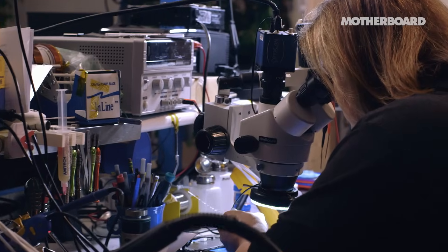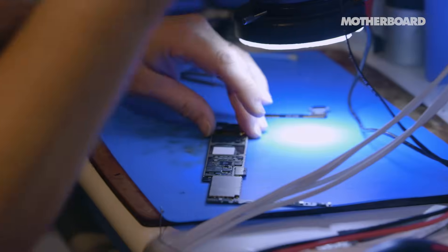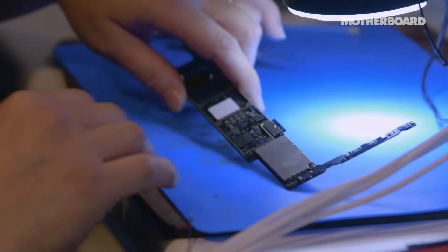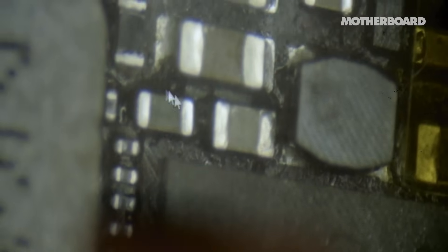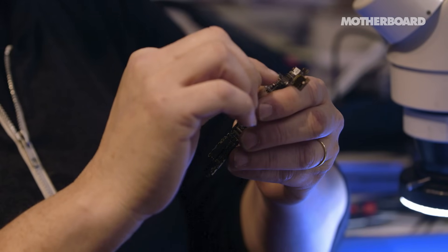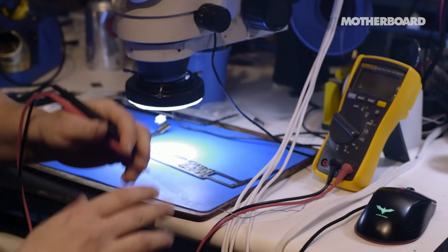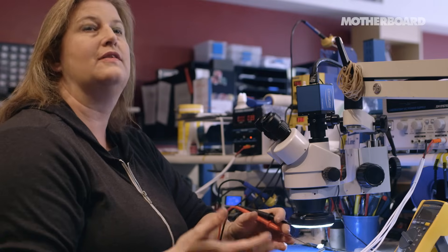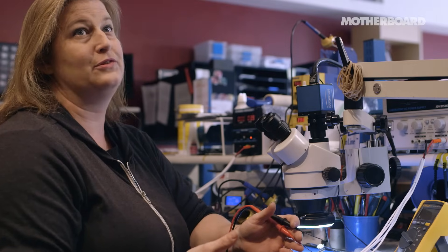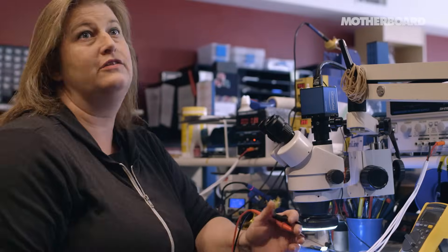So what does it take to micro solder? Number one: microscope. You can't solder without a microscope. The motherboard is generally seen as a replaceable part, but in reality it's a city of tiny components that are like Legos — any Lego that fails, you just switch in another one and the whole thing works again. The multimeter is an indispensable tool. This is what makes you a diagnostician who's able to use your brain and solve problems on your own. Without really understanding how to use a multimeter, you're going to be what I call a please-bro tech.